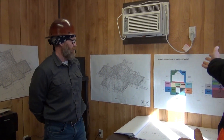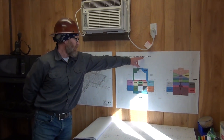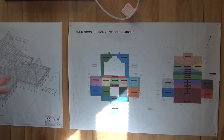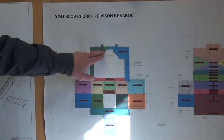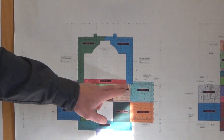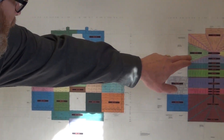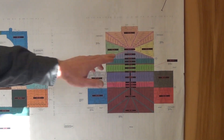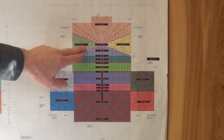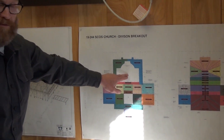This poster is a division breakout — the building is broken down into divisions for easier erection and sequence. We have G1 to start, up here on Rymel Road, then G2 and G3, making our way all around. Then we jump up an elevation and start erecting the big rafters that go to the peak, filling in everything from there. Before that goes on, there's a shoring tower already erected that will temporarily take the weight of everything.